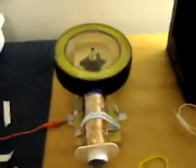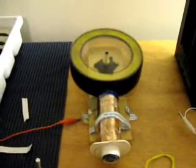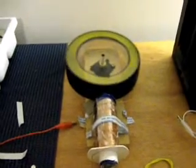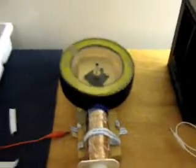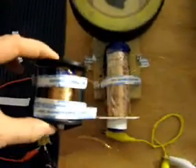This particular one draws about 400mA with these magnets. The Neos draw about 500mA, which is the best I can get it at. But that was with a different coil — this smaller coil here — so you can't really compare them.